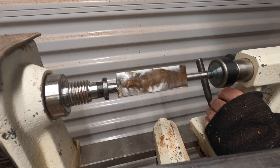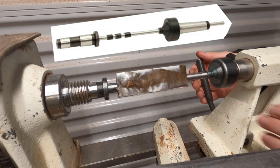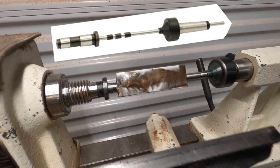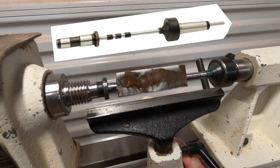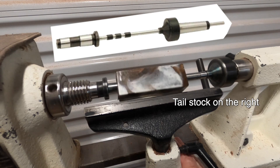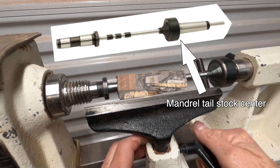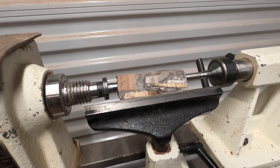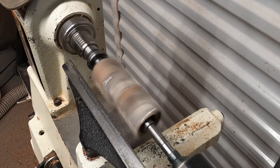Right now this is on a pen mandrel. I showed you that part in part two. One part, on the left, sticks into the headstock and the other part goes into the back. In this case I use something called a mandrel saver tailstock center. The actual mandrel goes right through the end of the tailstock. I tighten it down, and tighten down the tailstock.